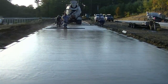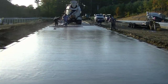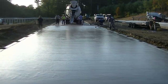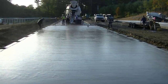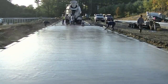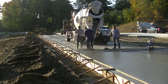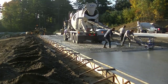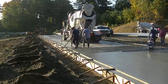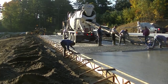The board on the screed is 12 feet, and the inside of the slab is 20 feet, so there's quite a bit of overhang with the board — that also helps make sure it's nice and level. Then I'll grab the bull float, and we've got enough handles to go across the whole thing, so bull floating this thing is pretty fast. At the end of the video, stay tuned — I'm also going to show you a small clip of us power troweling and finishing this thing, and the next video will show just how we finish these things.